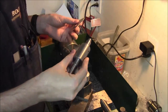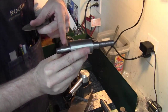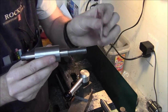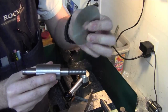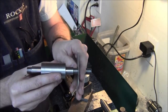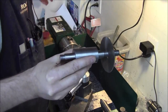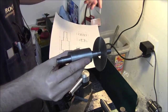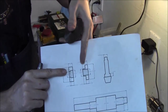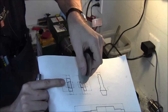So next up, we've got our arbor done, and this will be where the bearings ride on these journals here. Then the saw, which is a 5/8 inch diameter bore, will go up against the next two pieces we need to make. We're making the arbor flanges - basically two discs with slightly different shapes. This one goes inside of this one, and the blade sits between them.